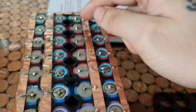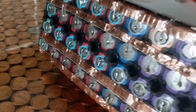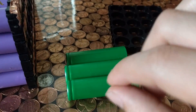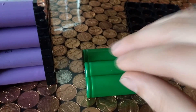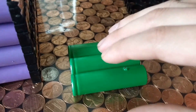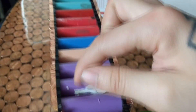Using these holders, the way I have it laid out is one side is the negative track for this line of batteries and the other side is the positive track. When you wire things in parallel, the voltage remains the same but the overall storage — the amp-hours — goes up. So the voltage stays the same but the overall capacity gets combined, and it essentially becomes one huge battery.